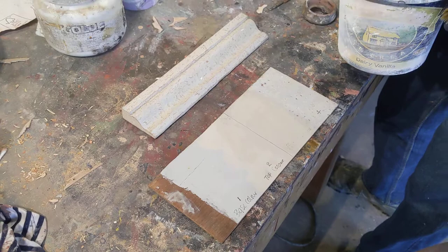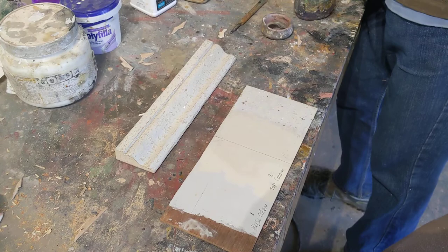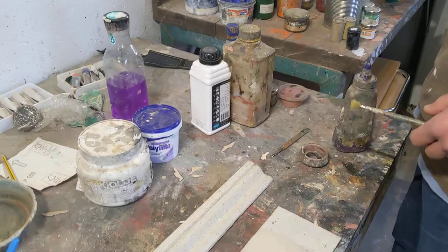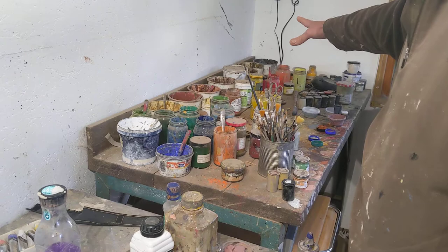So if you were making up a pint and a half, you probably want about six — something like six tablespoons. A lot, because it helps to take the flexibility out of it. And then you've got white and then you've got a lot less. If you're going to make it grey, I'd put raw umber in it. Maybe a bit of yellow ochre and a tiny bit of black. Don't want too much black because it goes a bit blue, and I don't really like grey that goes blue personally.